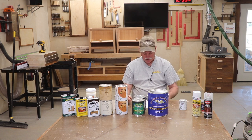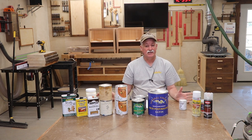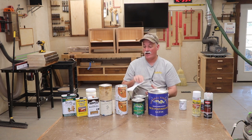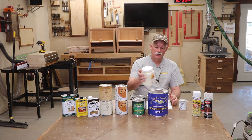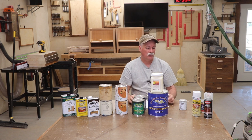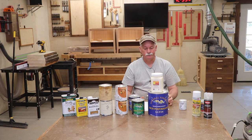What else is on my list? Oh, what about stains? I'm not covering stains in this. The only thing I'm going to mention around stains is if you're going to do that, you should use a conditioner for blotch control. Cherry is very prone to blotching.